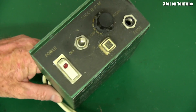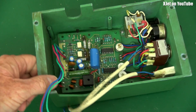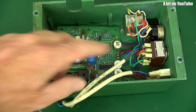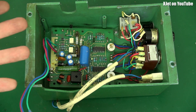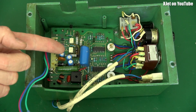I'm going to use one of the popular microcontrollers. I'm quite fond of PIC controllers, because they have a lot of the necessary components: pulse width modulation designed specifically for motor controllers, analog-to-digital converters for measuring where pots are turned to, and general IO lines to drive LCDs. The PIC series are really nice and super duper cheap. I do have a one-chip solution, but it's designed for 12 volts and of course we're dealing with 150 volts here, so it'll be a little bit tricky.